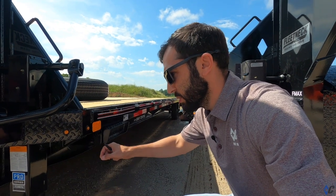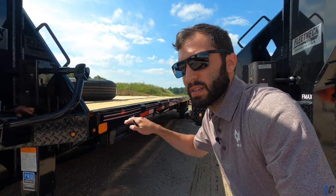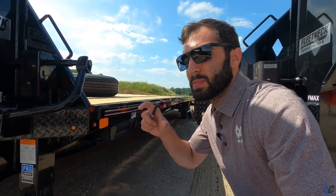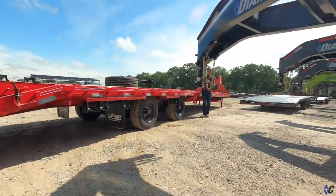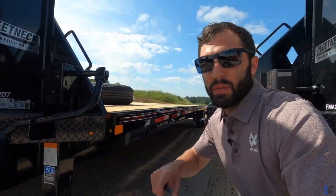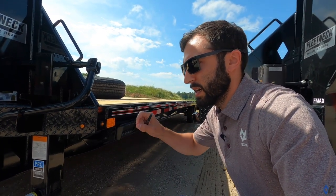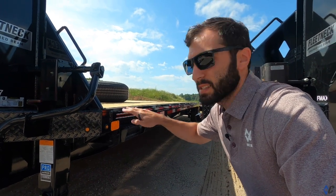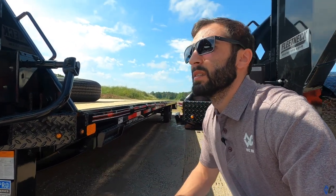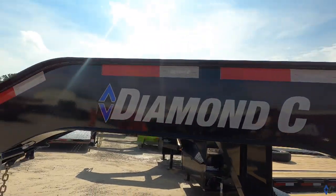And we have full control over the beam, the thickness of the material, the height, and there's a lot of power to weight ratio here. Now, on the shorter 207s, the weight savings is not as drastic as when you do, say, that air ride that Brian is standing beside over there. When they're that long, you get a lot more opportunity for weight savings. So the weight of this and a traditional I-beam trailer are a lot closer, but you've got massive power gains in the height of the beam and the yield strength of the materials.